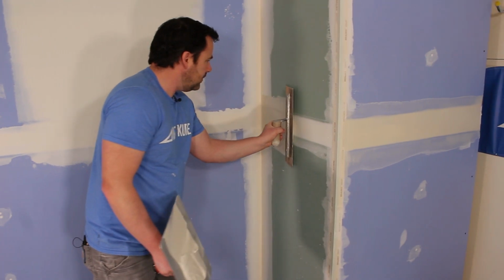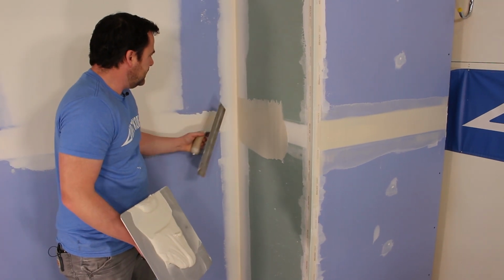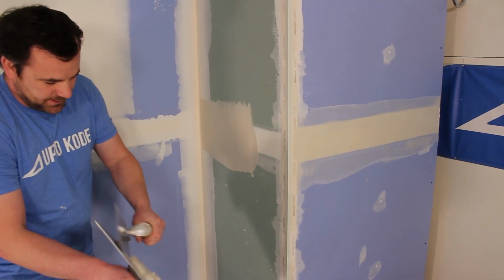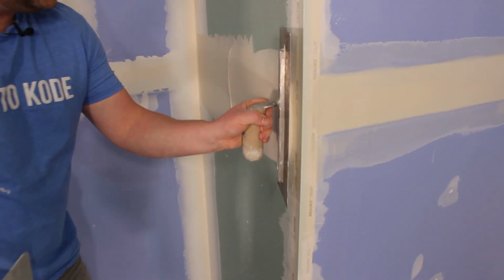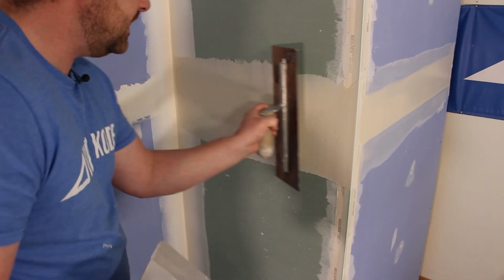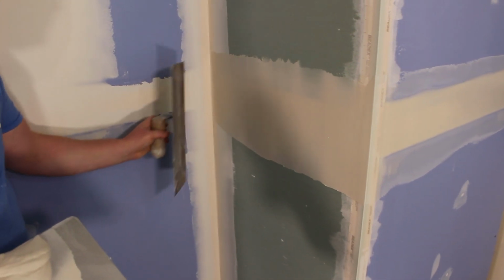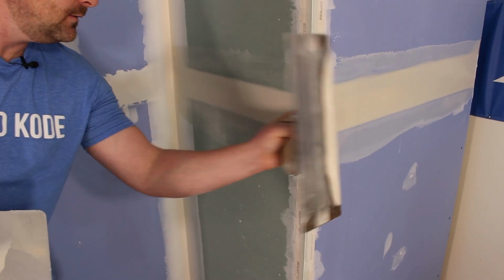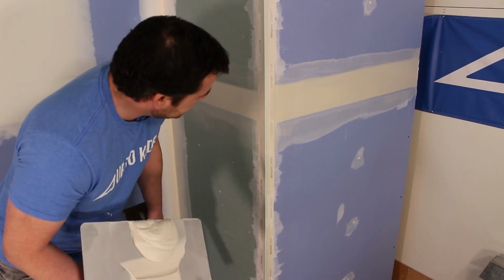I don't have to be like ultra tight into the corner, because when I wipe my angle, I don't really need a whole lot. Okay, so I'm already going a little too wide. I can just correct that, do a little bit, wipe that off. I'll just wipe it once really light just to get it consistent. And because it's a flat, I don't need to cut those edges. And just make sure you didn't build out anything on the bead, which I didn't, but it was close.